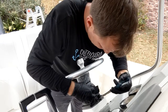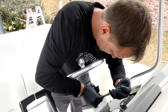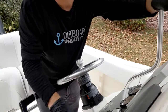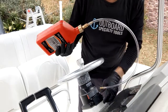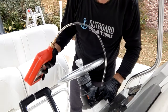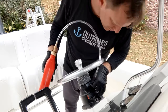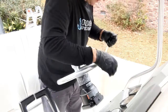Now we're going to spin our fill cap out — shouldn't take much effort. Next, connecting up the fill tube to our bottle. I don't have our threaded fitting in yet because I'm going to squeeze some fluid in and prime up the helm a little bit, basically trying to speed along the priming process as much as possible. Now I'm going to thread in our helm fitting, which we all know and love, and connect up our fill bottle.